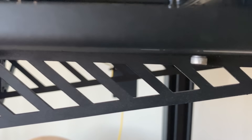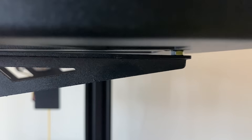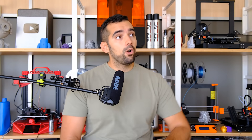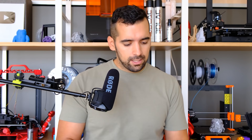I realized the rear carriage needed to be well adjusted. I also noticed the bed profiles were not well aligned — the bed was leaning too far forward — and the reinforcements under the bed could not be bent enough to correct it. My solution was to add an M3 bolt to push that section into position, after which the bed and lower structure became totally parallel. I think this may affect only early production units, but it is worth mentioning. Doing a mod before printing is advisable if you buy this machine.